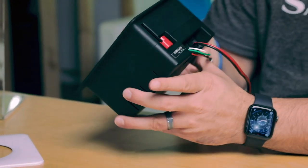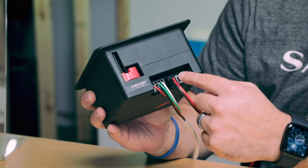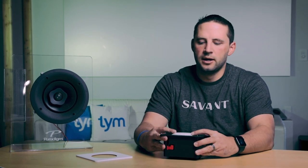You don't have to do it that way. If it's new construction or you already have volume controls, you can just run 16-4 wire straight out to the Veil Amp. If you look at the back of the amp, there are connections — one to power the amp, one to send power out to the speakers. There's also an Ethernet port, which isn't for network — it's to bring the signal in from the wall port if you're using an MP3 or iPod Touch as a local source.